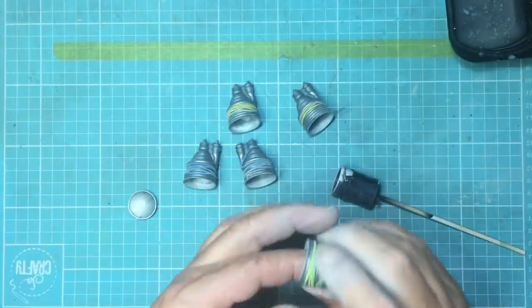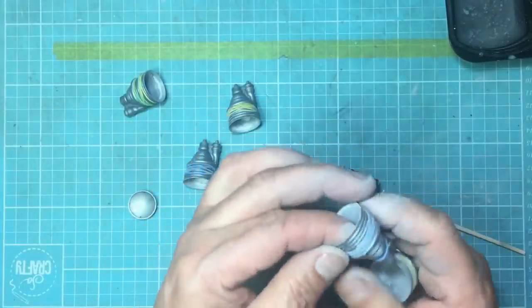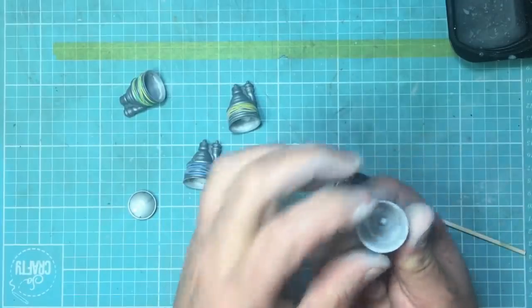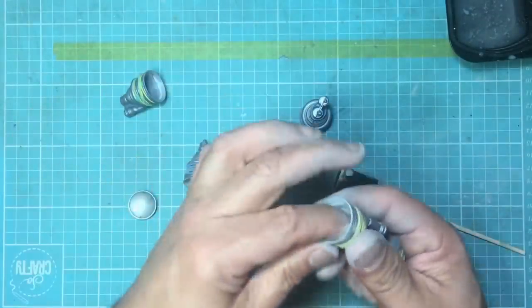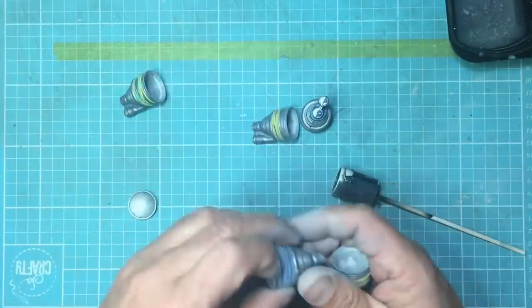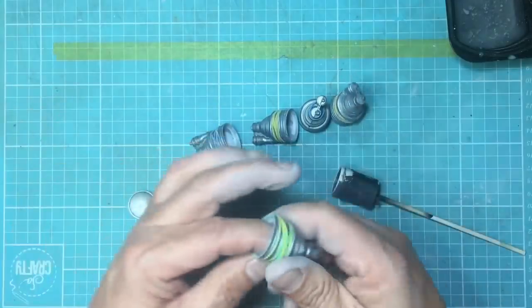Okay, so once again they're sanded down, and you can see they're all nice and smooth. We've got the high and the low spots you can see in there. So I can feel there's some irregularity in that one down in the bottom, but it's kind of smooth, so I'm not going to worry about it too much, and it is right down in the bottom. What I'm more worried about is everything between the end and here. As long as that's nice, that's all fine. And I don't want any big steps in that area. So I'm quite happy with that.